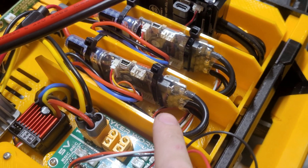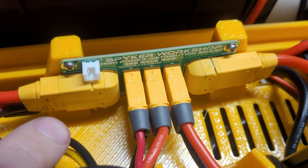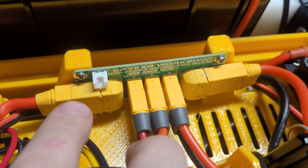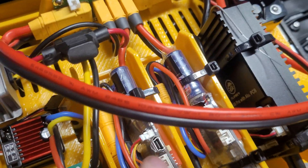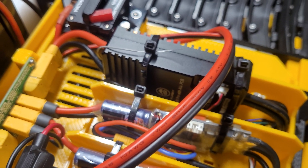You can see it's the high power distribution board. The purpose of this is to make the wiring a lot cleaner. You can see these brushless speed controllers — they can have just a plug put on them and then go directly into the board. I have several different connectors, so the power in is on an XT90 connector, which should handle up to 120 amps for a very brief time, otherwise around 100 amps. It's a pass-through, so the high current distributes to these three plugs, which can be used for the drive speed controllers. The end one is also an XT90 plug for a higher-powered blower motor.